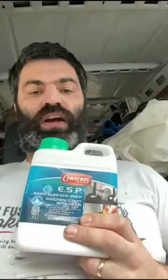The first product I'm explaining is ESP — Extra Surface Prep. I've been using this for over 20 years. If the surface is good enough and you just want it to grip, like formica, previously painted surfaces, or sprayed varnish with no nibs, put this straight on — no sanding required.